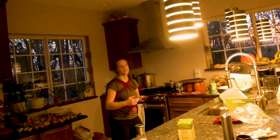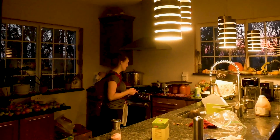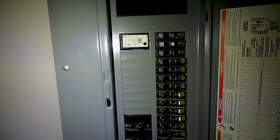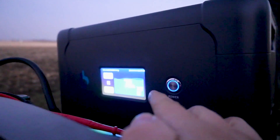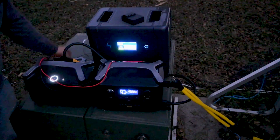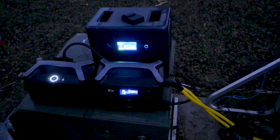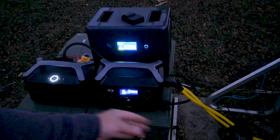Did you just turn them all off or did they all not come back on? They all came back on, but they liked it, so they asked if they could turn all the lights off to continue using their lantern. Let's see — this one looks like it's going to turn on just fine. But that one did trip. Let's go downstairs and look at why some of these didn't come back on. I wonder if it's the ground fault. None of these breakers appear to be tripped. So maybe our plug came out outside. It looks to be plugged in just fine. It's definitely this one that's working. This one's not. Something's weird here. I just switched which power bank is supplying that end of the cord and it looks like it is working now. This one's outputting the power that the other one used to be. So I think we must have a loose connection or something between here and where it connects to the house.